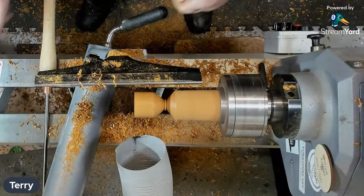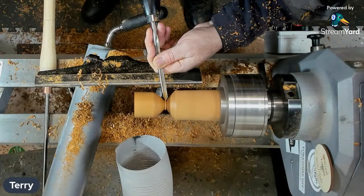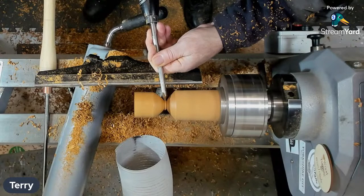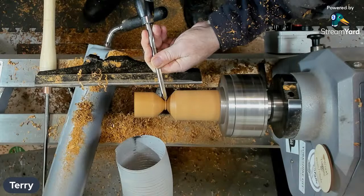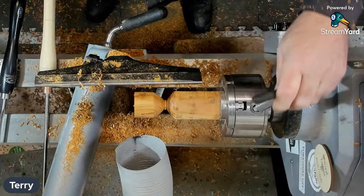Bailey Woodworks says he's used a wood hardener or a good sanding sealer for punky wood. Sometimes I've taken white glue, carpenter's glue, and mixed it half and half and submerged the piece in that. And then let it dry for a couple of weeks and then turned it. Yeah, that would work, I think. A thin solution of PVA.